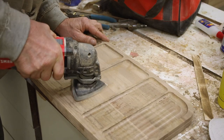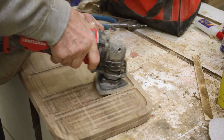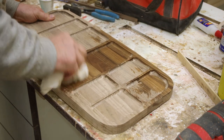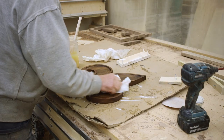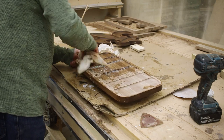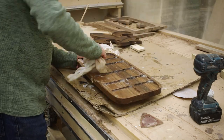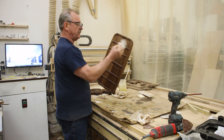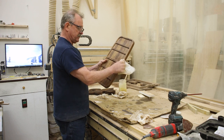Fortunately this profile sander fit right in between — a lot easier to sand than the other one, didn't take near as long. I did the same water trick with it, then eventually came back and sanded it out by hand as well. After quite a few hours, went ahead and wiped all the excess off. Came back to the other charcuterie and went through the same process. After a few hours we just wipe off all the excess dried wax and we're done.